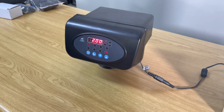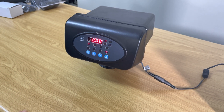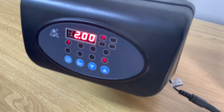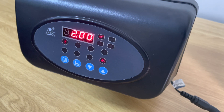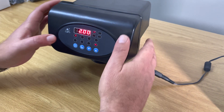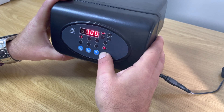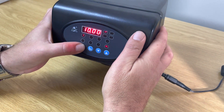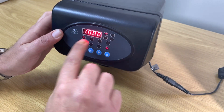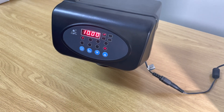This is where you set your volumetric — how many litres need to pass through the vessel to start the regeneration or backwash process. It's currently set at 2,000 litres, shown as 2 m³. We want to take it up to 10,000 litres. Press the square button, it shows 2, we take it up to 10. Now set at 10 cubes — press the square button and it's now set at 10,000 litres when it will start backwashing.